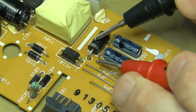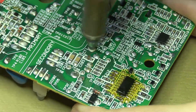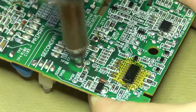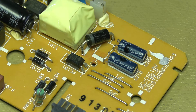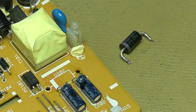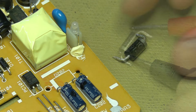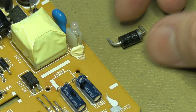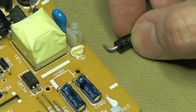Let me show you which diode exactly. These are the capacitors for smoothing directly after the DC output. Measuring again — yes, that is a solid short. So either it is this diode or some circuitry around it. Let's remove this diode first and measure it on its own. Measuring it — solid short confirmed.